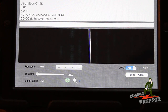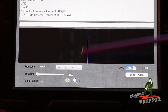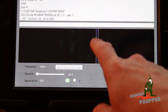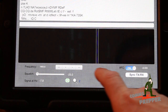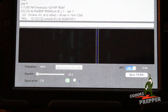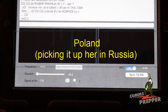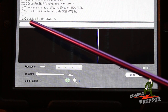Okay guys, we're picking up a transmission here — we've got somebody calling CQ or any station. You can see the shaded green lines coming down; these are the waterfalls of the individual stations transmitting. We'll try to pick up a conversation here. We've got a station calling CQCQ outside of EU, meaning somebody in Europe wanting to call outside of Europe, and their call sign is SK9KWS.